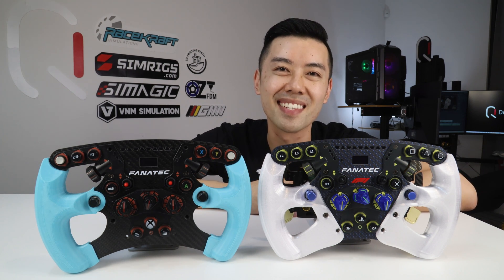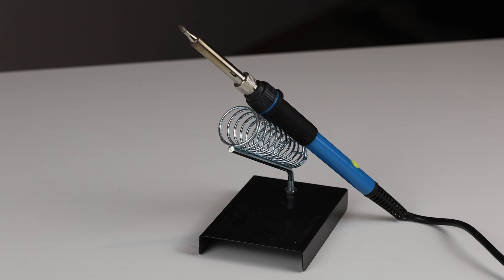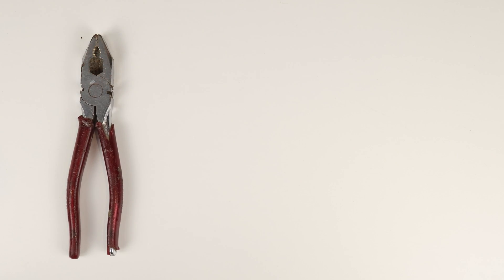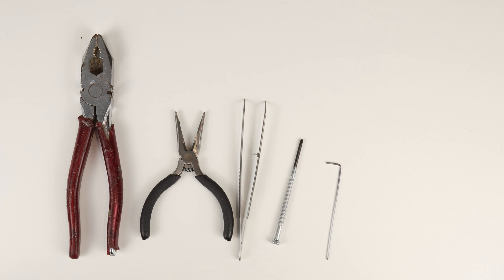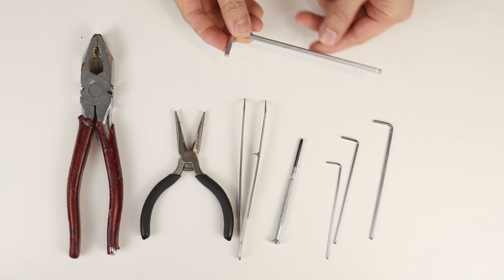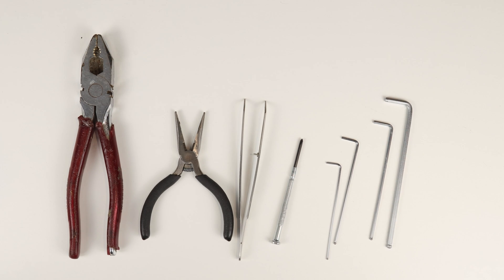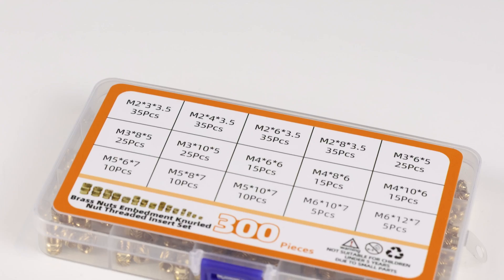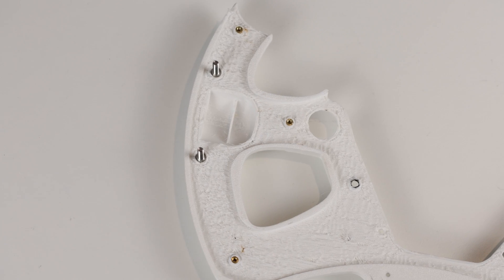In terms of equipment needed: you'll need a 3D printer and a soldering iron. For hand tools you'll need pliers, needle nose pliers, tweezers, a jeweller's Phillips head driver, and metric hex keys — 1.5mm, 2mm, 2.5mm, and 4mm, with the 4mm preferably being longer with a ball end. You'll also need socket head cap screws — M3 by 16mm and M2 by 12mm — and brass threaded inserts, M2 by 4mm deep and 3.5mm wide, which you can get in a combination pack from AliExpress.